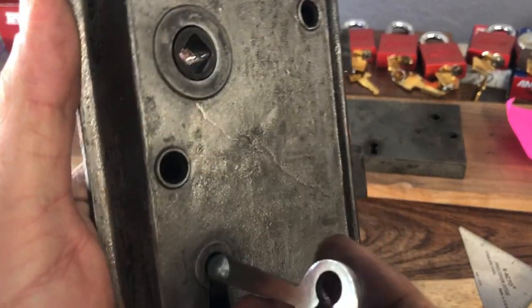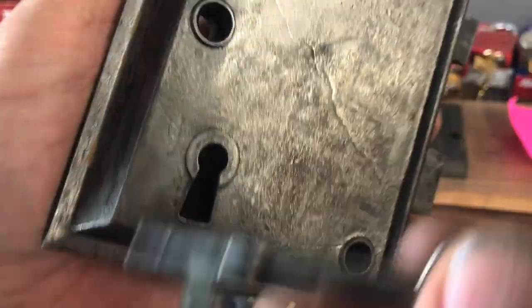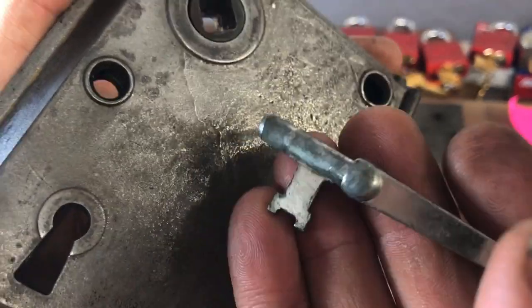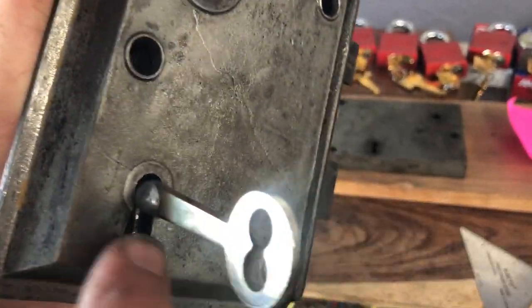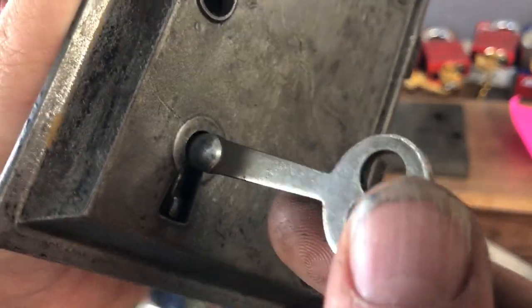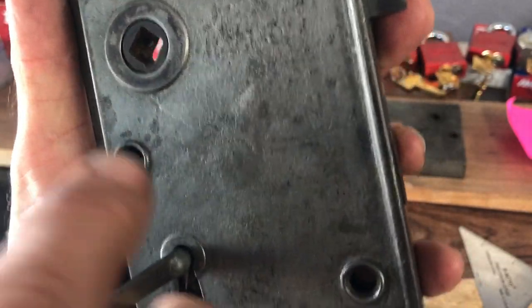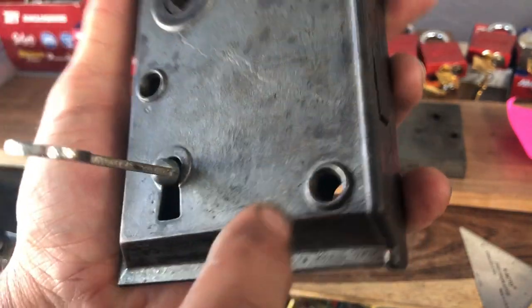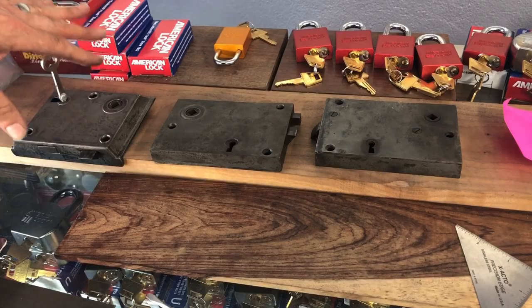Already made a key for this. It's got a really big hole, and it has to have a stop. And the only key blank, I'm not fond of these lead shoulder blanks, but that's the biggest one that I had without doing a lot of fabrication to an existing key, but it's kind of an "is what it is" thing on that one. Got that done, it kind of goes like that around the edge of a door.